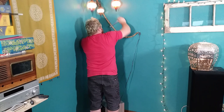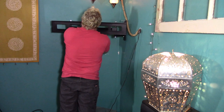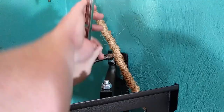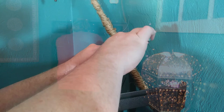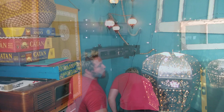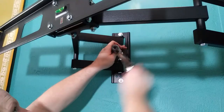At this point, you can grab the wall mount and get it up into place. This is considerably easier with a second set of hands, but can be done by yourself if necessary, as shown here. Once the bolts are started, it will hold itself in place. Ratchet the bolts down fairly tight, then grab a level before pre-drilling the bottom holes. Place the level on the side of the bracket, adjust the angle until it is level, and then drill your bottom pilot hole. Get the bottom bolt started, then tighten the top and bottom bolts all the way down. Once you have that done, pre-drill the final middle hole and get it tightened down as well. If you have tightened everything down nicely and all of the bolts are hitting a stud, there is no way that this thing is going to move.